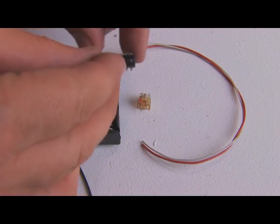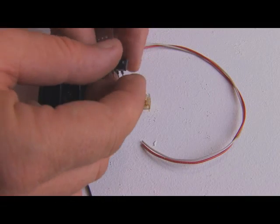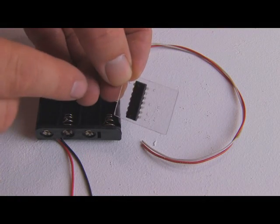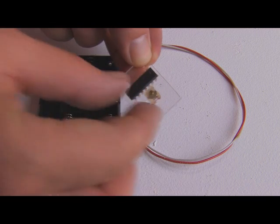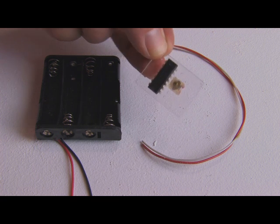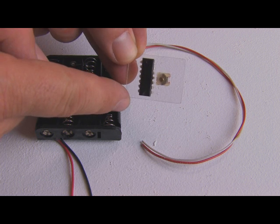Here's our chip. You'll notice the chip has a notch right here that tells you where the first pin of the chip is, and when you're counting your pins, if you're looking at the little schematic, that'll give you a clue. So there goes our chip, which is mounted on the perfboard, and the capacitor just goes like that, and then we'll connect our battery leads, and our antenna, and a couple of jumpers, and that's going to be it.